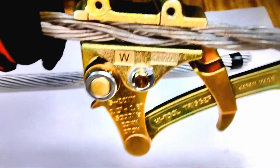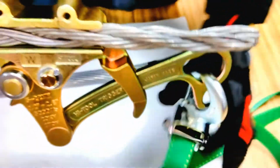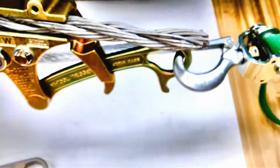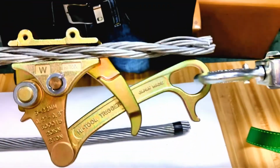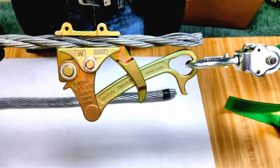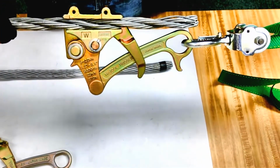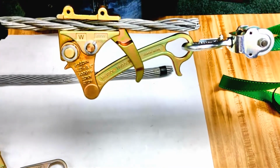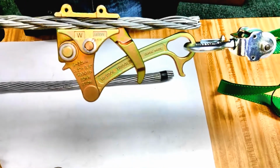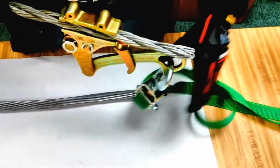Now let's say I'm going to put in a steel strap, a web strap hoist to pull it. You'll notice that when I pull it, this thing isn't moving anywhere. Okay, that's due to the nature of the aggressive teeth. It can clamp down very, very firmly onto the steel material, and it won't slip out at all. Okay.